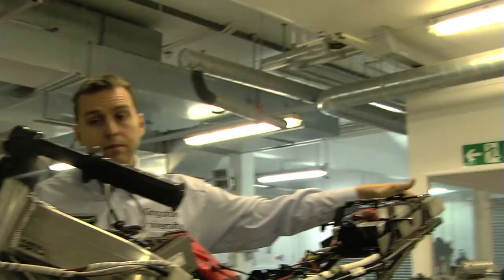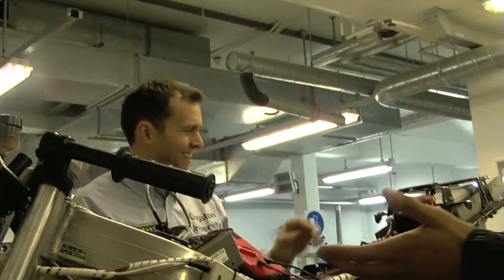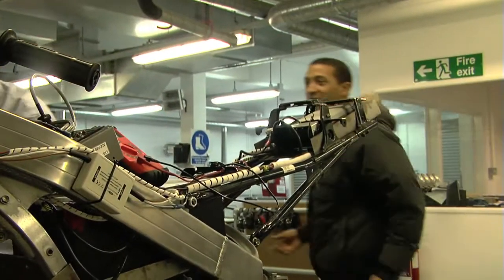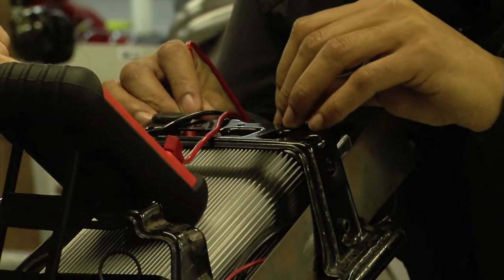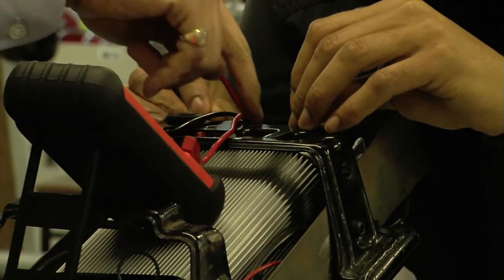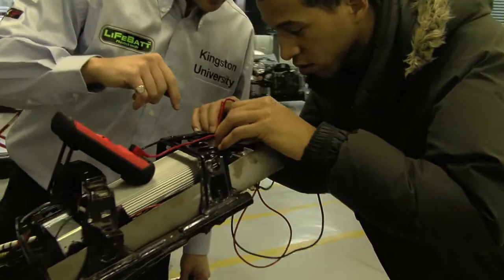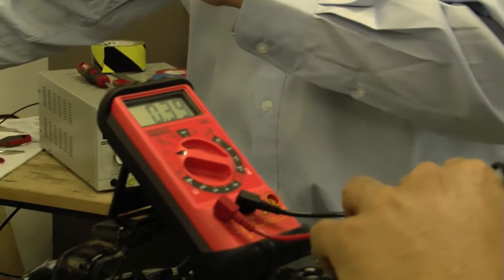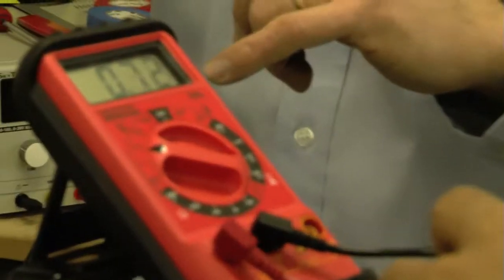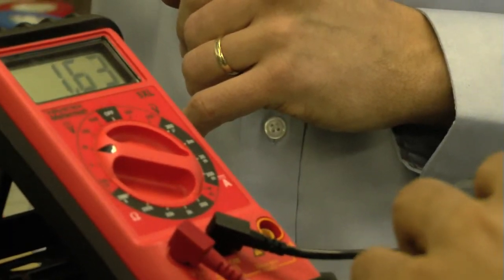Can we just power the output to that and see if you can't overload it? No. You see what I'm saying? I do see what you're saying — it could damage it then, couldn't it? Yeah. So it's sending out 4.94, and then if you put it on the blue one, which is the signal at AN2. So we were starting off at about 0.8 volts when I was giving it 5, and we're going up to 7. That's well off.